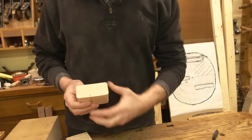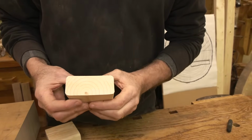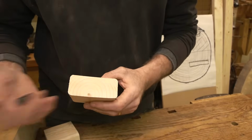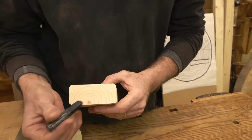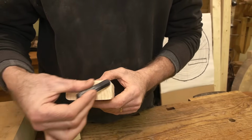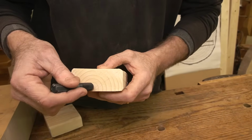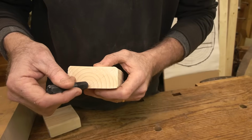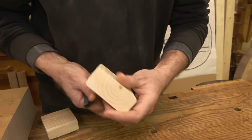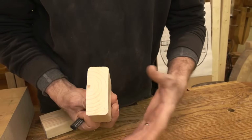That looks familiar, right? So you're getting the growth rings here. You know what? I don't even know what kind of wood this is. Is this fir or spruce? Someone who's in the building trades. I never really work with this for furniture grade, but I counted out, this is about 10 years old going out this way. Another way that they determine the density of growth rings is to measure how many per inch. If you just come out per inch, there's only 4. So this was a little bit lighter, and it would be perfectly passable for a stud in the wall.